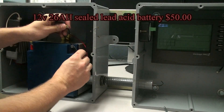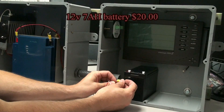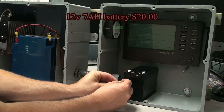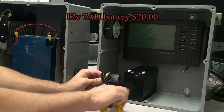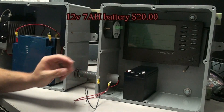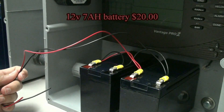This whole system uses about half an amp power draw. We have a total of 40 amp hours battery capacity, giving us an operating duration of 80 hours in total darkness. Your system may be sized differently depending upon your location. Once you've added sufficient battery capacity for your system, connect the last battery to the charge controller.